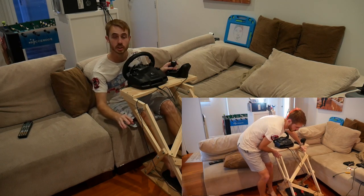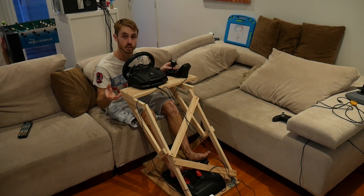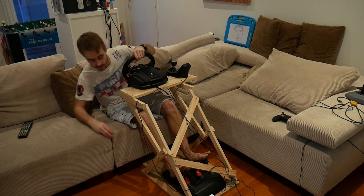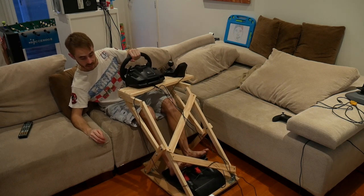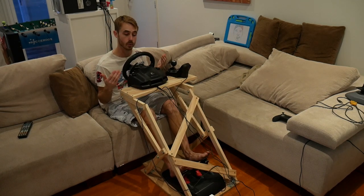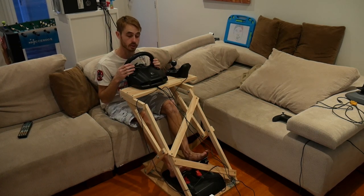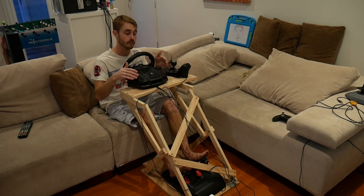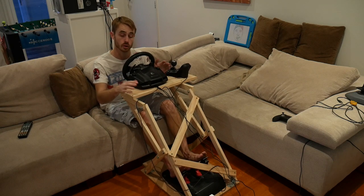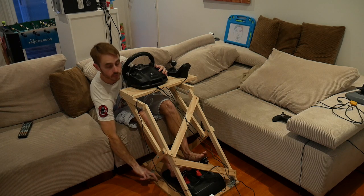If you were looking for a bit more rigidity, you could replace the lower MDF shape with something much thicker, say a 30mm piece of timber. The problem isn't actually the stiffness in the frame — the frame is plenty stiff. The problem is that I can actually lift the entire front of the simulator off the ground because the weight is quite far back. The more weight and stiffness you have in that base piece, the less of an issue that's going to be. So you really have to weigh up portability versus performance when deciding what thickness to use for the base. The rest of the frame is super rigid, so you can keep it the same and just increase the weight, strength, and stiffness of the bottom member.